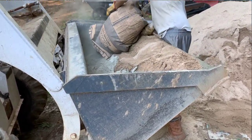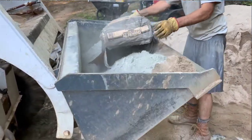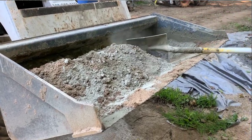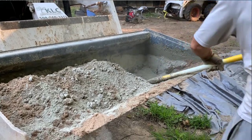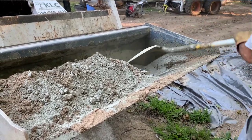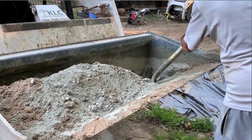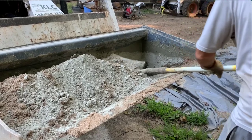What I found to work best was to go ahead and measure out the sand and then mix in the Portland with the sand and stir that up dry first, getting yourself a good mixed-up formula. Then once you've got your sand and your concrete mixed adequately, go ahead and pour out a portion of your water into one edge of the container.